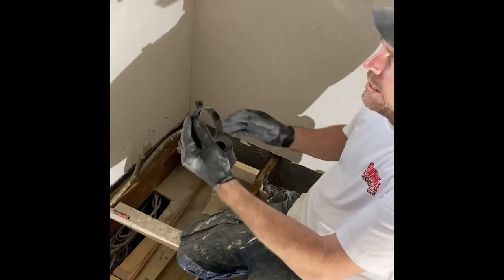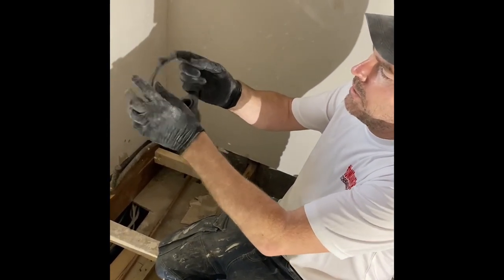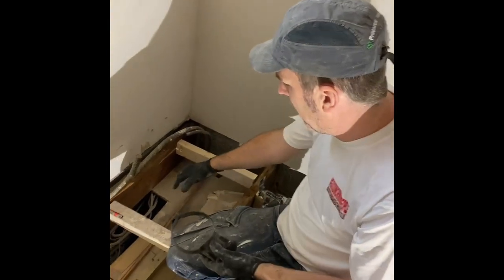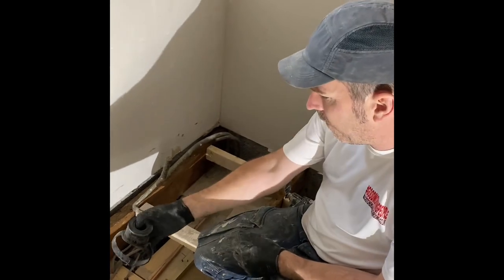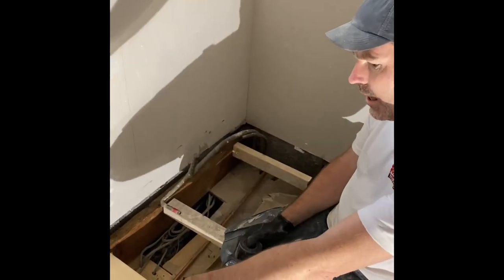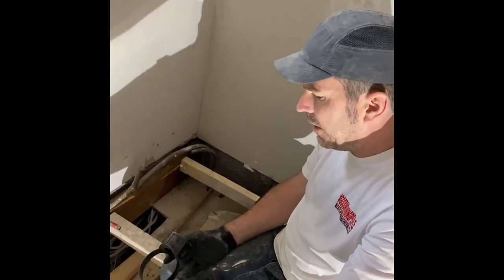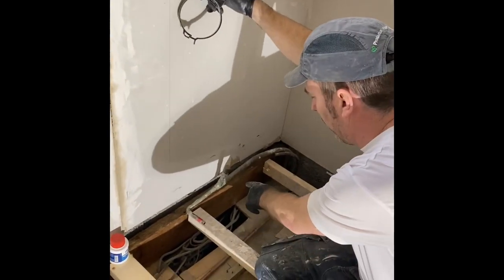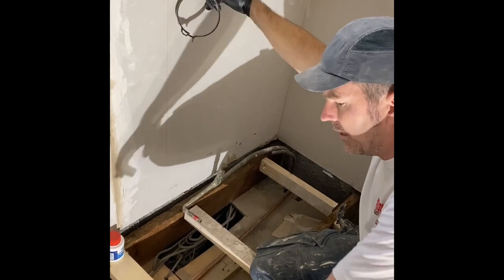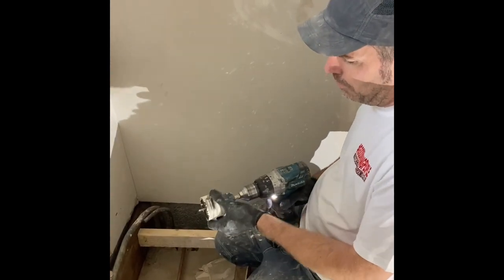If you're struggling, you can cut that off and it'll still clamp up. Makes a big difference to try and get it down back of there. We'll pull them cables out, get his boss in, and then we'll straight up cap that all up because it's all old antique pipe that I ain't got no fittings for. Then we'll get his bath waste in there, bring his bath waste down to here. Unless I've got a reducer, I might use my little snap ons.